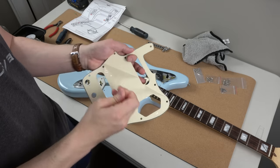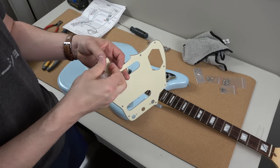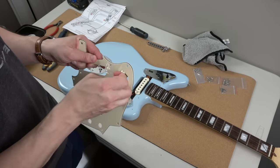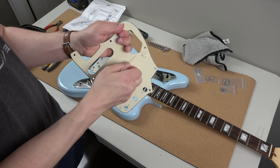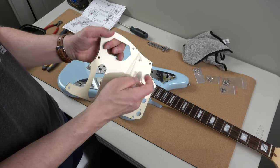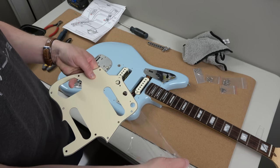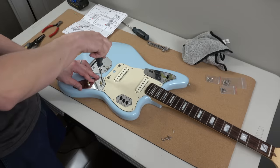Pretty good. I did realize one thing after. I think I needed one more body ground to the... you're just listening to the looping, so sorry about this. It's got two layers for some reason. I don't know why. Anyways, the metal plate where the volume and the tone controls are, it needed another ground. So I'll show that in a second here.